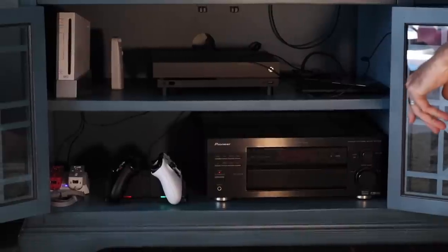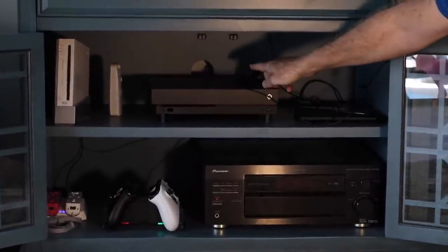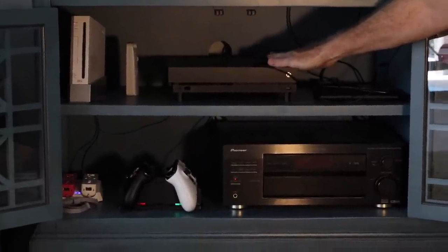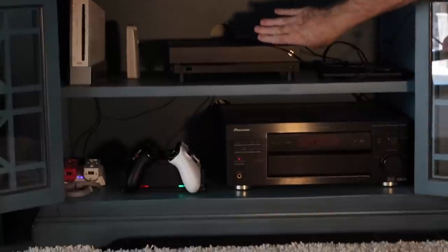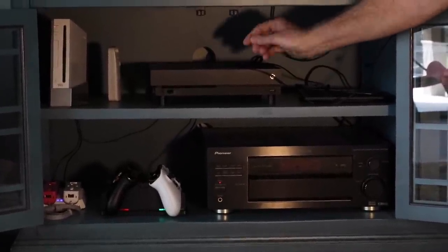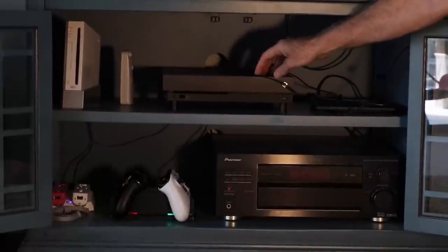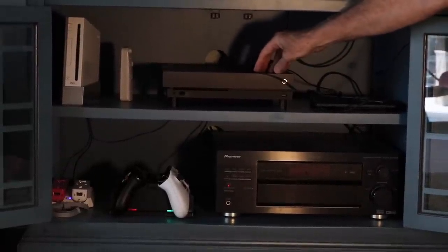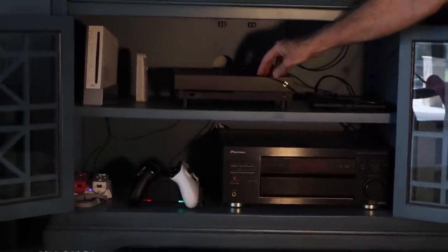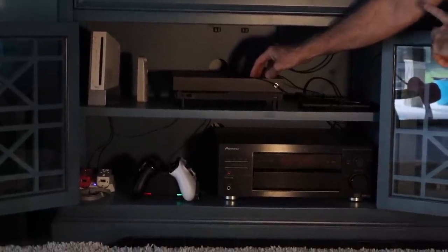There's a quarter inch piece of plywood on the back. There's a hole in the back center where some of the wires are passing through currently. I'm going to mount the Airplate to that because it's up towards the top where the heat is anyway, and see if we can't exhaust the heat that accumulates. Right now, I ran the Xbox for 3 hours, and the temperature in here with the front doors closed was 99 degrees.